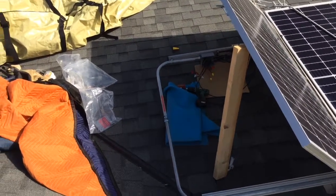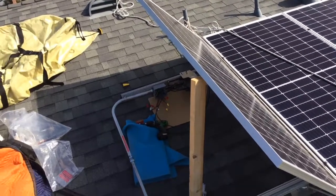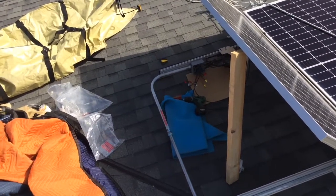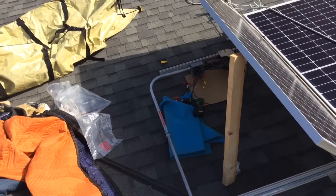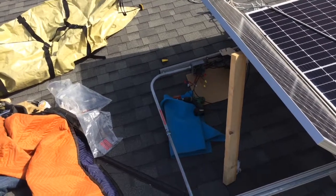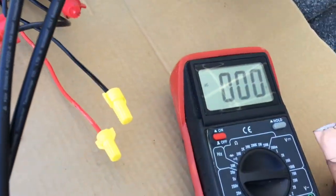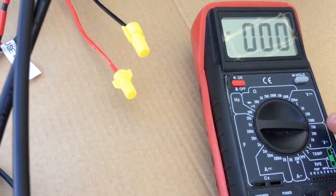I found a perfect piece of wood — it's a nice prop and it's also providing some shade. This gave me new enlightenment on how you would construct for servicing. If you need to access the J-box to add on or debug a problem, it's nice to have that in mind when you're placing your J-box and rigging up your panel.